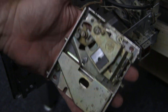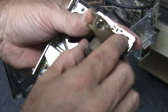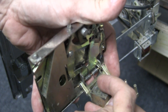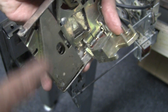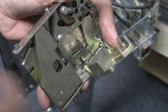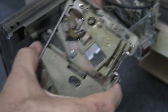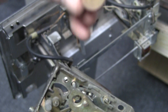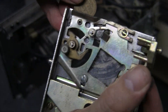Let's take a look at this coin mech. There's a swivel part here, and you see this big square on it — that's a magnet. The reason for that is it's part of one of the anti-cheat devices, because quarters don't really have any ferrous material in them — they're not magnetic. So if you try to put a slug or something with a high iron content through, the magnet would grab it and not let it fall. Here's a token — actually this is non-ferrous too, so it's going to hit one of the other mechanisms based on the size of the coin.